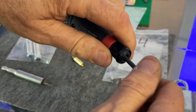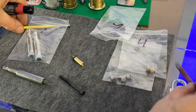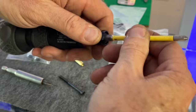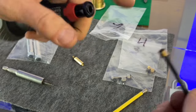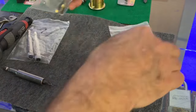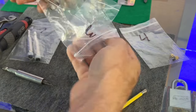The good thing about this insert is it typically won't fall out by itself - you need the installation screw to get it out. The downside is if you wanted to use an actual Vessel bit, you can't because the insert is in the way and the Vessel bit would be too long and fall out. To remove: just screw the installation screw back in, pop it out, and you're done. That's option two.